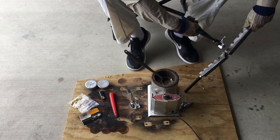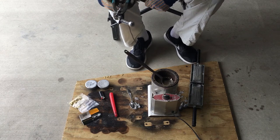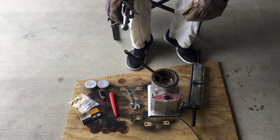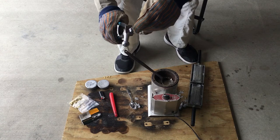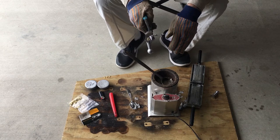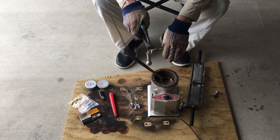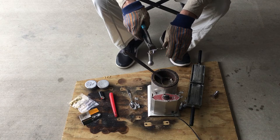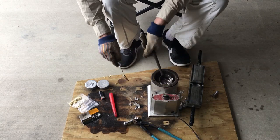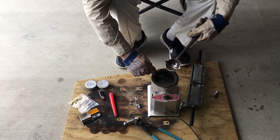Don't hit the mold — and there you go, nice little sinker. All you have to do once it's cool enough is take your pliers and cut this top part off. When you melt your lead down — whether it's wheel weights or whatever — try to clean them up as best you can. Make sure there's no moisture, no grease. They're gonna be dirty so you're gonna be cleaning off a lot of slag, probably every five minutes or so depending on how dirty it is.